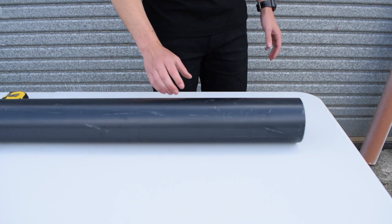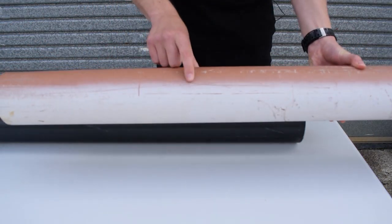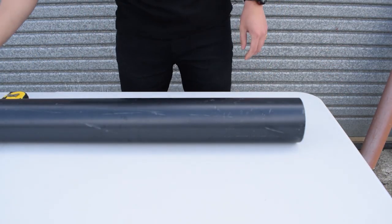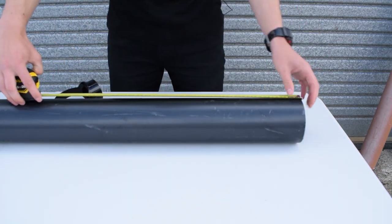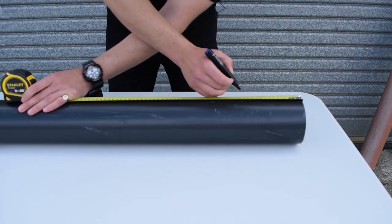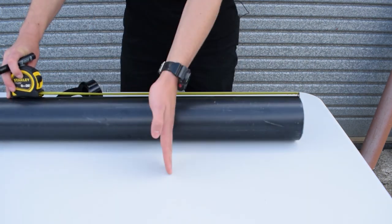So we're going to measure out our manifold. It's important to use black or grey soil pipe — the orange soil pipe is for underground use only and will go brittle and bleach in the sun. This is a floating manifold. We're going to account for the end cap and the spacing between the float guards. I'm going to leave a generous amount of space between our saddles, measuring 150mm and 450mm, and the reverse will measure at 300mm and 600mm. The saddles will alternate sides.